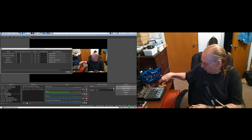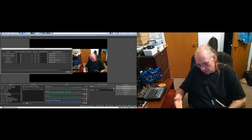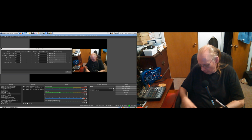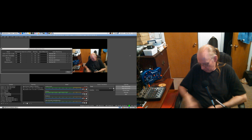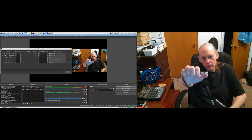Stereo has got a right and a left and a ground. Balanced has got, I saw the diagram in the manual, and I think that is right. I'd forgotten, but it has a ground, a hot, and a cold. And they're not anywhere near the same. Although you can use a TRS cable, they're actually not even the exact same dimensions, but they didn't used to be when they were closer in tolerance. The distances on the tip, ring, sleeve. See, there's the tip, the ring, and then the sleeve, the long one.